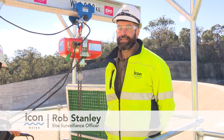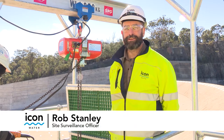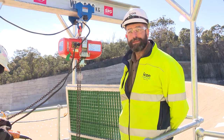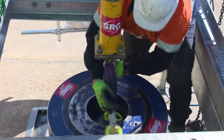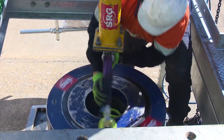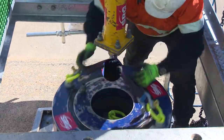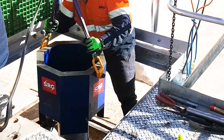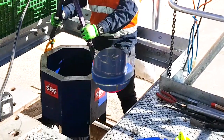What the guys are doing here today is conducting anchor testing on the Gugong Dam spillway to ensure the safety and compliance of our spillway. There's a three-piece component — the lifting head gear. The guys down here at the moment are screwing the first part of three pieces onto the anchor head that is cast into the bedrock.